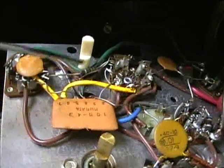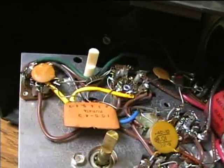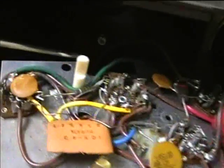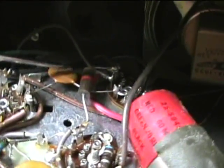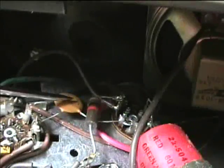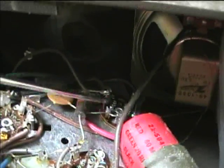It's a pretty small resistor — usually in bigger equipment that's a bigger resistor, or you've got fixed bias. Here's your volume control, and there's the variable capacitor control. Down here is a capacitor — this is probably just a noise suppression capacitor. It connects from the rectifier tube to ground. And this is a filter resistor.